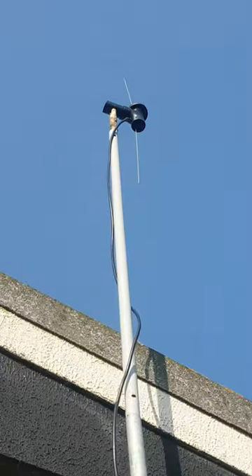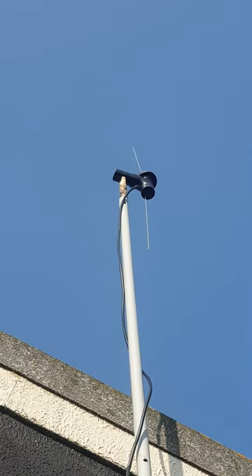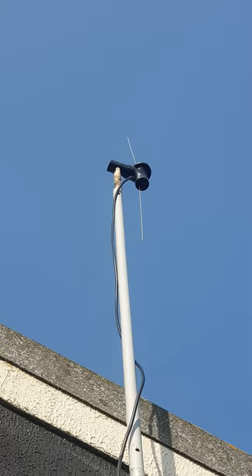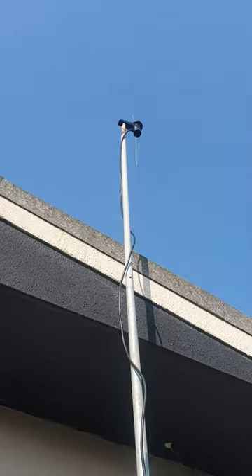Then you can run it up to a dipole — it's a homemade dipole. That should put about another 10-12 miles on your radius. It's all homemade, made up from bits and pieces, didn't cost anything — just a bit of coax.